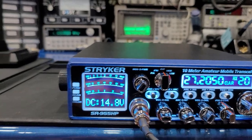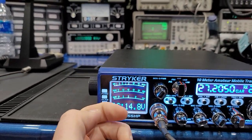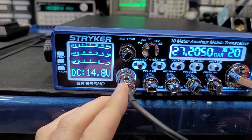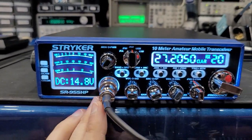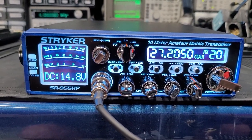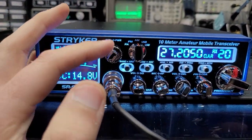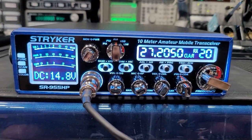On my own radio, my own base station at home, I have a relay built in that whenever I key the microphone, it automatically swaps over to my monitor radio to capture my voice line level and others' line level. That's the dual monitor setup that I offer. It's just an extra option that can be done if someone had a second radio, a second monitor to listen to themselves on. That way you can capture both sides line level. But the talkback works just fine for capturing your voice. It's just not true line level. I just want to make sure everyone knew, that's why I'm explaining it.